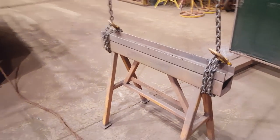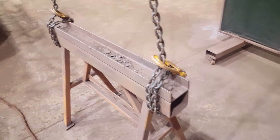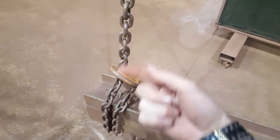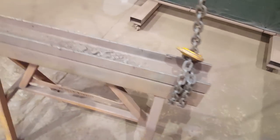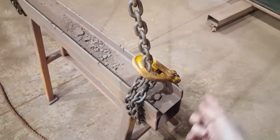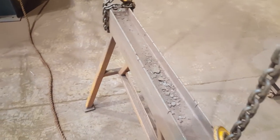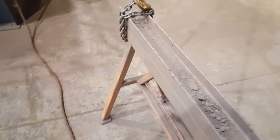This is a classic example of a double wrap. So if the crane driver goes, 'hey bro, double wrap it,' this is what it means. All it means is you put the chain around twice. Before on the choke we went around once — this is a double choke, or a double wrap. So you want to go around once and then once again, and choke it. That's a double wrap.